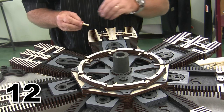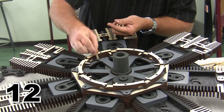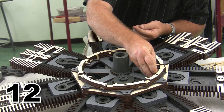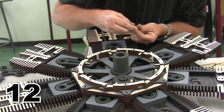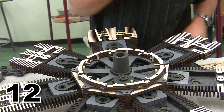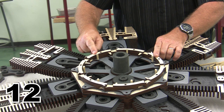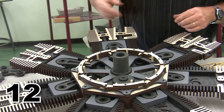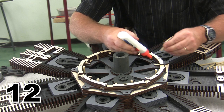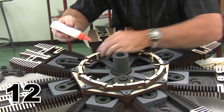Our next step is going to be to fill the valve case, and the first thing we need to do is we need pins that are cut to the right length for our pivot pins on our valve lifters. Now, if this is a single size model, this pin should be cut to about 5 layers thick. Well, it's actually 5 layers thick regardless. It's just 5/8 or 5/4, depending on which thickness of model you've got. Those pins are permanently going to become a part of this particular model. So it doesn't hurt if you go ahead and actually glue these in from the back. You can wait and glue these in from the front. It's kind of up to you, but I'm going to glue mine in at the back because that way I don't have to worry about what to do with the glue at the end.